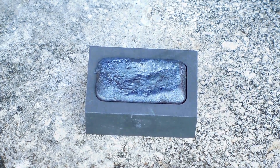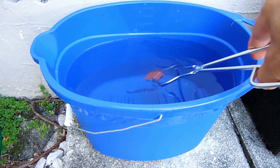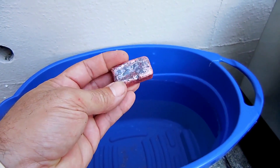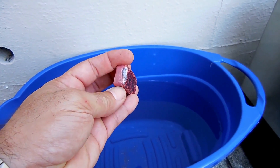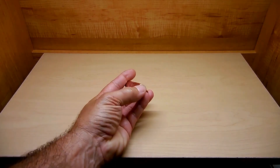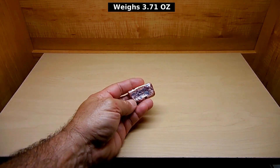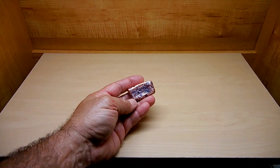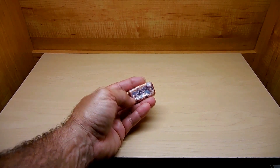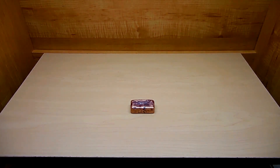I'm going to let that cool a minute and then dump it in the water. Okay, wrapped in — this is what it looks like when it's cooled down. Let me give it a good cleaning and we'll see how good we can get it to look. Here's the bar after I polish it up with the wire wheel — see the corners are nice and round. There is some slag on the surface that's copper oxide that I didn't scoop off, because I just didn't have the time to get the graphite rod in there before the liquid copper would have cooled.